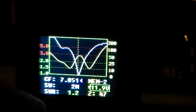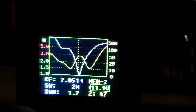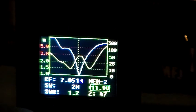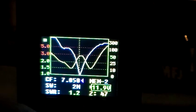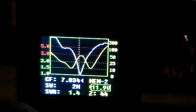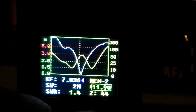1.2 — it's still not going to bother anything. I could nip that in with the ATU very easily, but I'm just giving you a demonstration of how you can look at the bandwidth of the tune on your ATU — how far you can deviate from your centre frequency before you need to fiddle with it. So that's 7.051, now it's just gone to 1.3, then 1.4. To get to a 1.5 SWR — there you go — 7.025, that's 1.5 to 1 SWR.